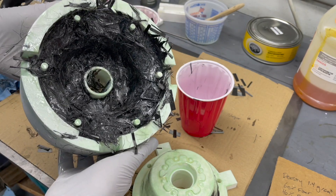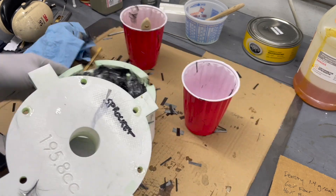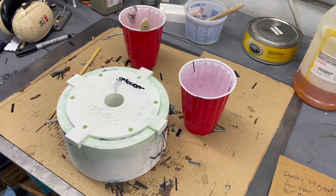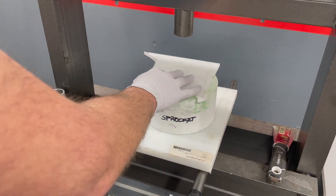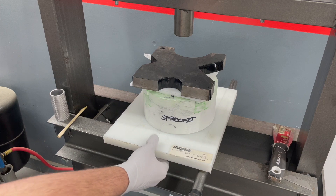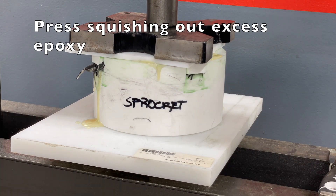We now have a fully loaded up mold — a little bit of cleanup around the edges here, then this will be headed over to the press. Edges are cleaned up and we can close up this mold. You can see it snugs up there, maybe a quarter inch left to press down. We're over at the press and we are ready to get this mold squeezed down. I've been using HDPE — the epoxy release is really nice from it. We'll leave that to sit for a few minutes, then come back, give it a little bit more of a squeeze and repeat that process a few more times. Then it sits for about 24 hours and then we attempt to free it.